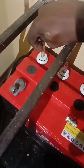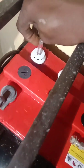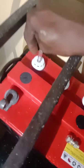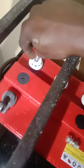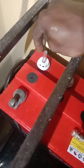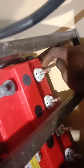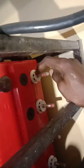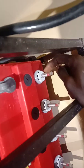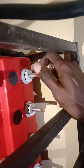On each gauge there is a line painted green and a line painted red. Once the red cap you are looking at is dropping below the green line, that means the water content is already dropping. Once it's on the red line, it's at danger level. I advise customers that once the red cap is at the middle, you should top up the battery — don't wait until it reaches the danger level. You can see here the red cap has dropped a little below the green line.